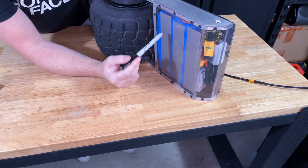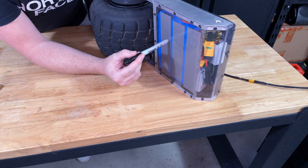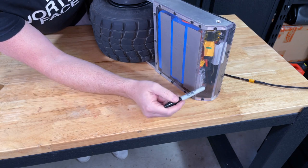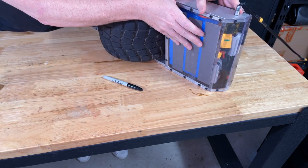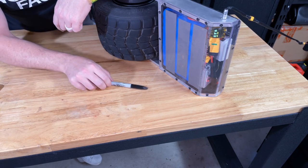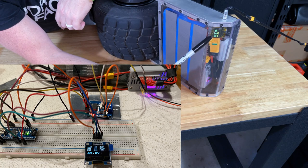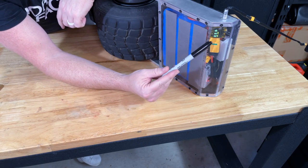The battery pack underneath is a 12S 3P Molicel P42A pack — the same number and type of cells as a One Wheel GT, but in a 12S configuration instead of 18S, so fewer volts but potentially more amps. There's a Flexi BMS Light up front as a charge-only BMS. There's also a small OLED display hooked up to an Arduino, which talks to the BMS via CAN bus to display the pack voltage and the voltages of each parallel group within the battery pack — because I still can't quite trust what BMSs are doing in DIY projects like this.